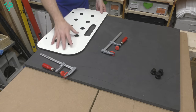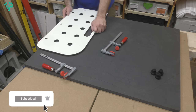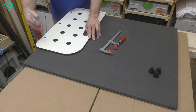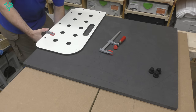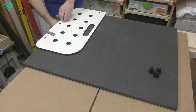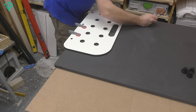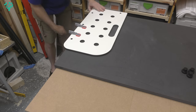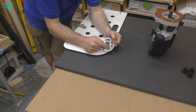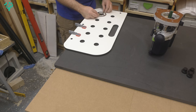I'm just making sure that the jig is actually referencing on the edge of the black material and not on an overhang of the MDF — that would be embarrassing. It's looking good, nice and clear, so I can clamp it into position and make sure everything is referenced tight. The pins are referenced from the edge, and that's referenced — now this is going to work best if your 30 millimeter bush is actually 30 millimeters.